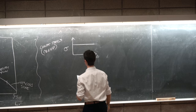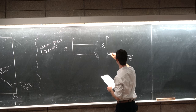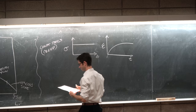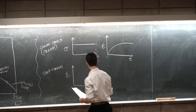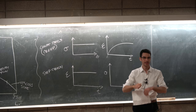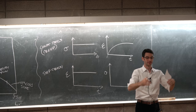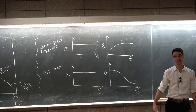In a creep test, you apply the stress and measure the strain over time — depending on the sample, you might get a time-dependent elongation. There is an analogous experiment: applying a step strain of some amount and then measuring the stress via a force gauge over time. You instantaneously stretch the sample, and the force is greatest at the beginning, then may decrease to some value depending on where you are on the temperature curve.